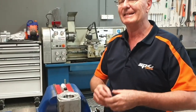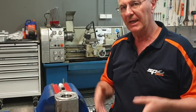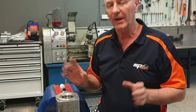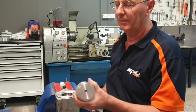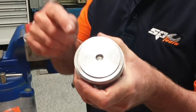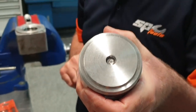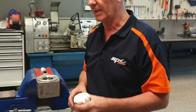The best type of stud remover is one that does not expand the bolt. With a lot of the stud extractors on the market, they're tapered and as you screw it in they will expand the top of the bolt, which is absolutely fine if the bolt is proud. However, when the bolt is broken off flush with the thread, we can't afford to expand that bolt in the thread because it's only going to make it tighter.